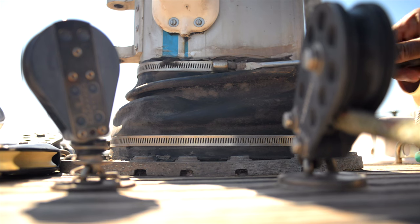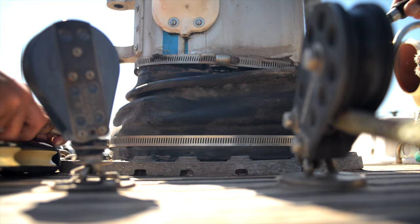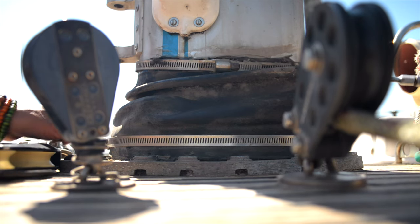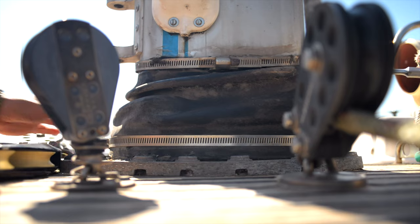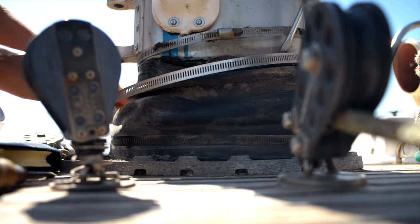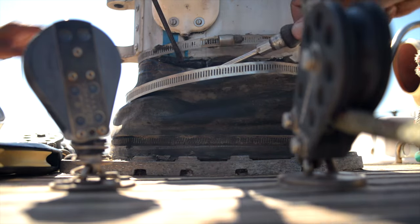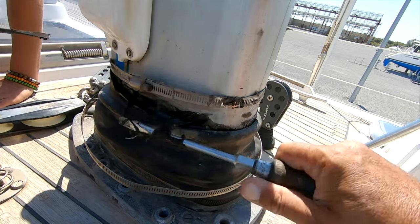The disadvantage is the space between the mast and the mast hole, where both sea and rainwater can flow down into the bilge. To prevent this from happening, you have to find the best fabric to seal this hole tight, and that part can be tricky.